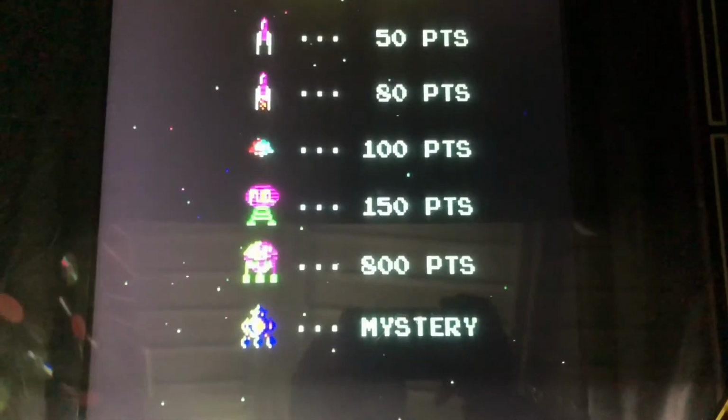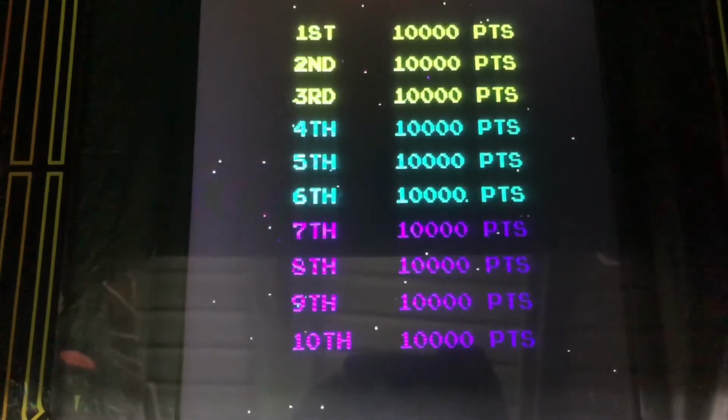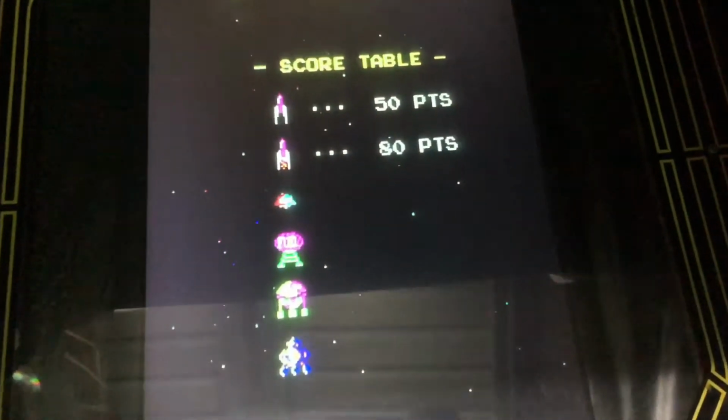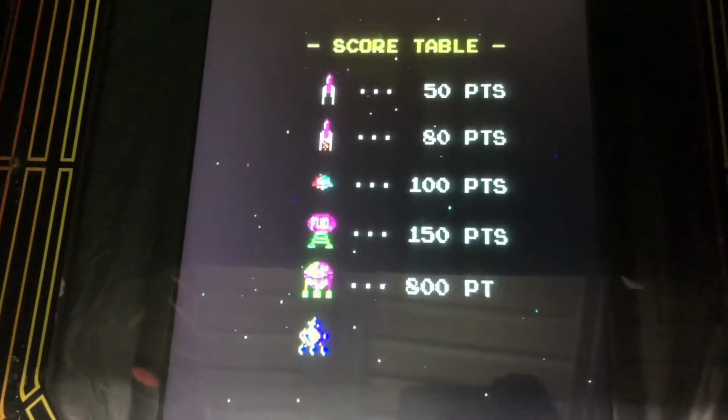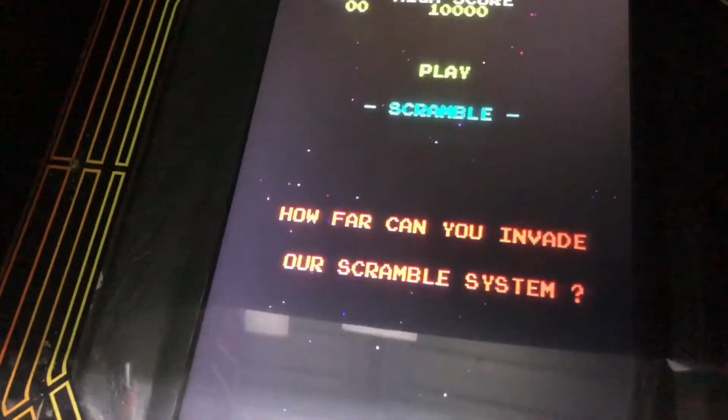Maybe it's a loose connection on the board or IC or something. We're going to have to look at that. Yeah, so even when it's not playing, it's glitching in the demo mode. So there's something wrong with the ROM, I believe. And we'll pull the board back out and we'll have a look at it. But yeah, this board was heavily played around with and, well, molested, let's say. So it might even be just a loose IC chip. But let's pull it out and have a look.